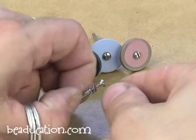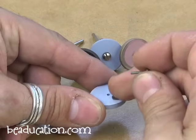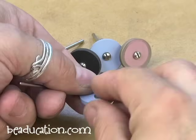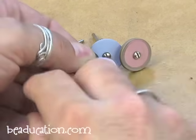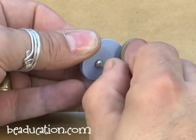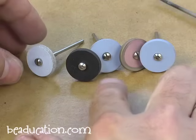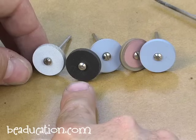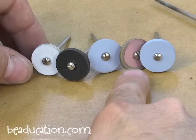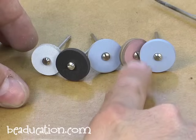To mount one of these wheels onto the screw mandrel, undo the screw. If you have the little washer, put that on one side going towards the shaft of the mandrel, then slip the wheel on top and screw it in — that gives a little buffer between the mandrel and the bit. These bits are very good at removing metal, polishing away defects like extra solder, fire scale, and deep scratches. As you go to finer grits, they start producing a satin and then mirror finish. Because they're a little bit harder than some other bits, the finish is brighter and more burnished looking.